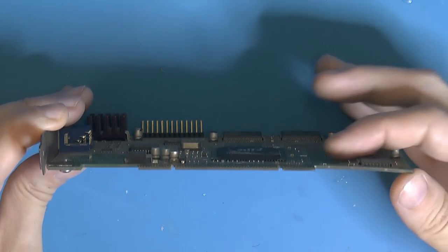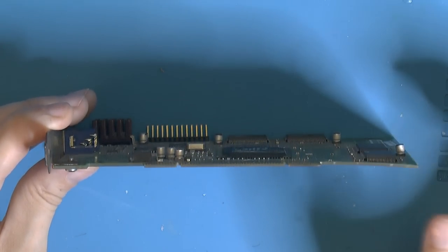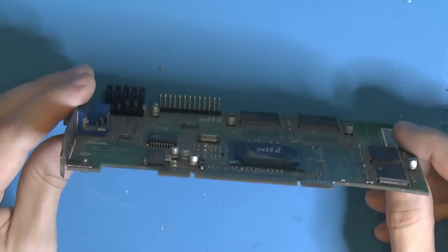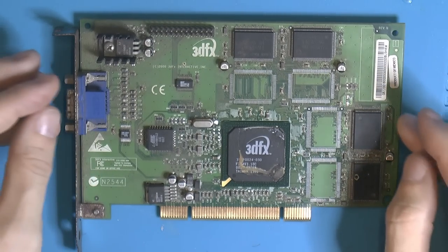And you probably need to overbend it a bit, so we need to bend it up over just a little bit. Most materials tend to spring back a little bit. So he recommends 130°C. I don't remember for how long, but I think it's either 2 or 4 hours. I was thinking, can I clamp this down on my hot plate? I should be able to reach 130°C with my hot plate on this.